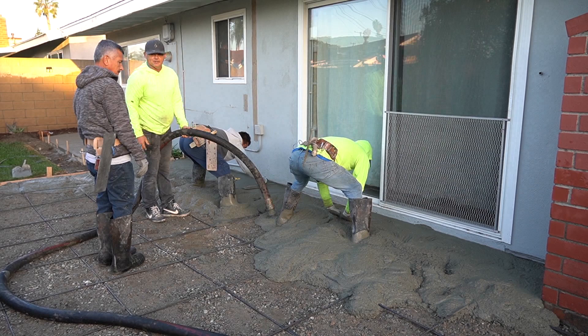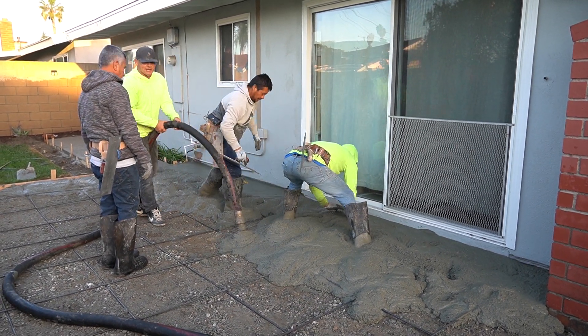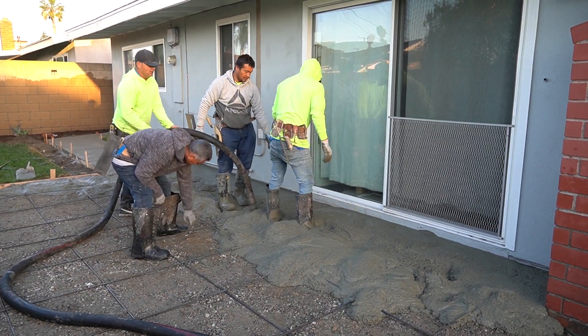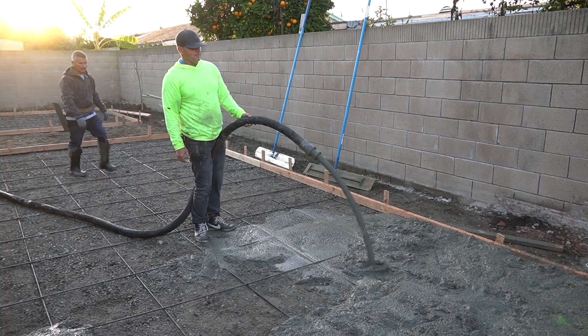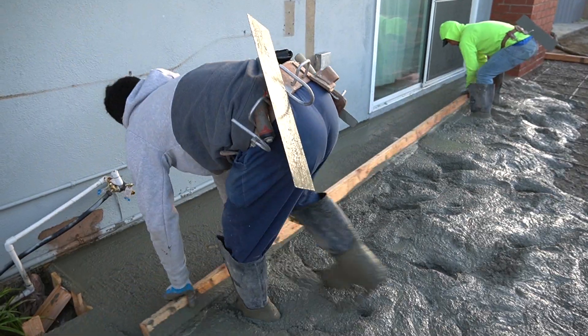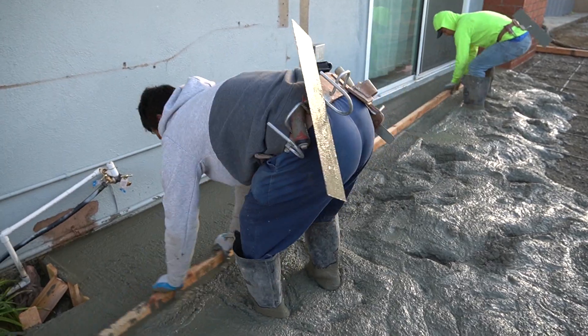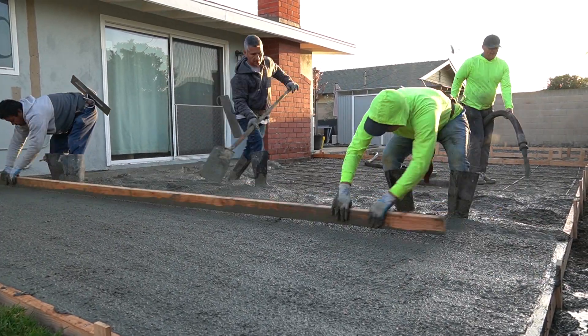What we're doing is laying it down off the house to get the fall away from the house, then we'll turn and burn the opposite way, because you've got to get the water flowing away from the house. Once you get that, you use that wet screed — turn and burn sideways to get the flow out the other way. We'll get the house first and then turn. That's a 16-foot rod stick.